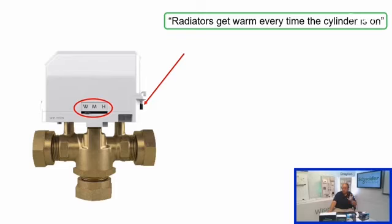That means essentially when you kick the boiler in on water, for some reason the valve is not seated, so we are getting some flow into the radiator circuit, just not the same sort of volume as we would if we're calling for it, and that's why it's reflected as the radiators just starting to warm. They're not as hot as they would be under normal circumstances. Now it could be again that there's an obstruction in the body of the valve.